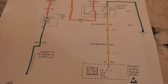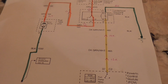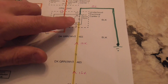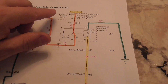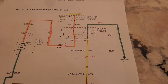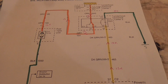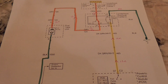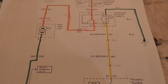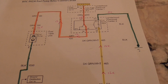The circuit will not activate if either side of the relay is not working. You have the control side and the switching side - if you're not getting power, you don't have a ground, or there's a damaged wire, it's not going to work. I just wanted to cover this simple lesson before we get on to the relays that involve a zero-turn tractor.